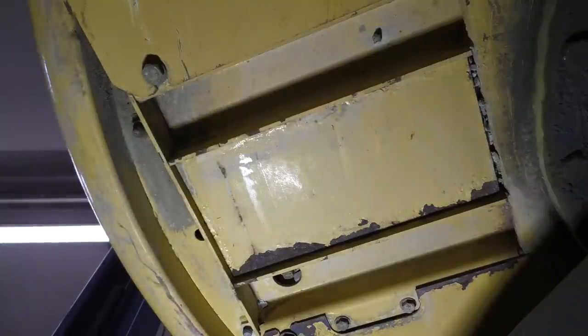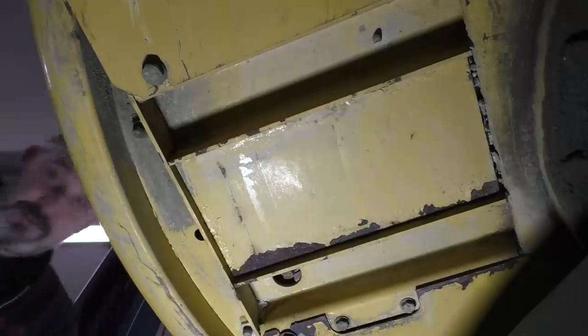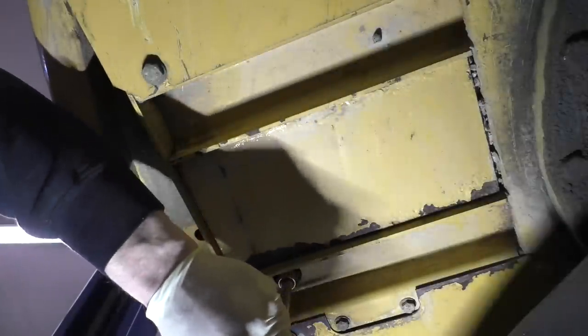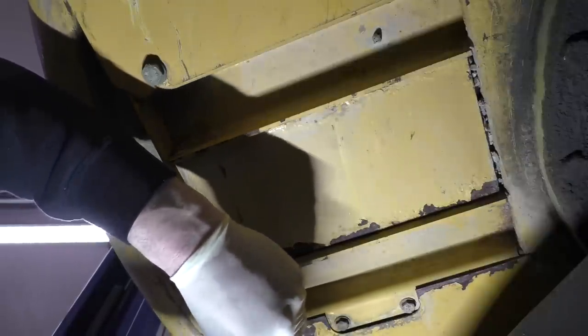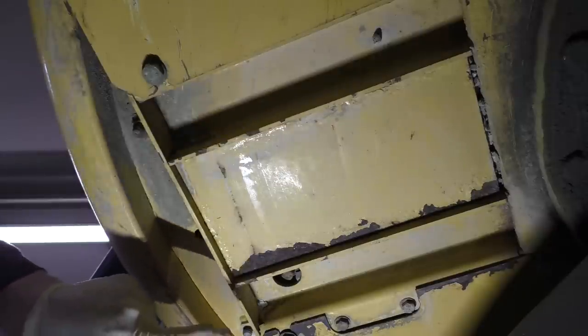Before doing this, though, we did have it running. Let me crack the cap loose out of it. This system does build pressure. That would have been an experience we don't need. Okay, so drain the pressure off it. Get to where we can give it a handy, and then we'll get our bucket ready. Okay, so I see a little liquid come out there. And then you can do a drain on this just like you can with the fuel tank sump, because there can be water in the bottom of this also.